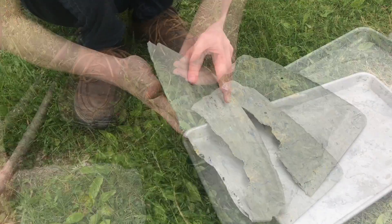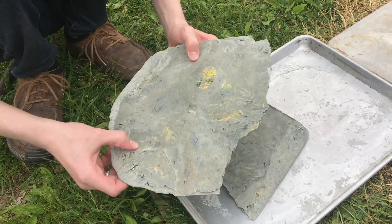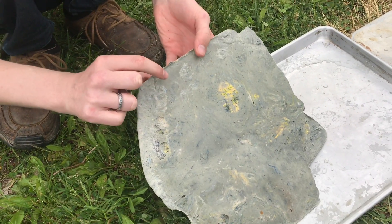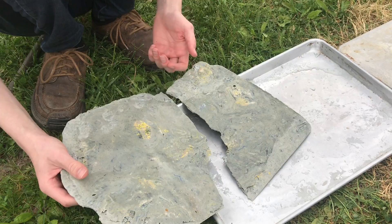It's really good stuff. Keeping the temperature down will reduce the amount of burning in the plastic and give it more strength. Next pour I'd like to do it a little bit thicker — maybe three-quarter inch — and that would give it more strength as well. But every time you do this, you learn more.